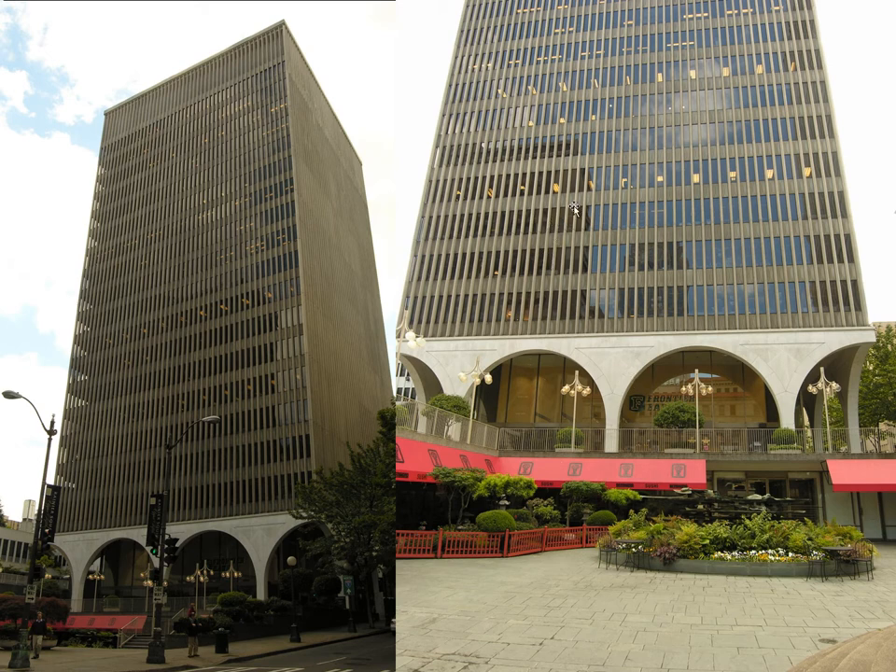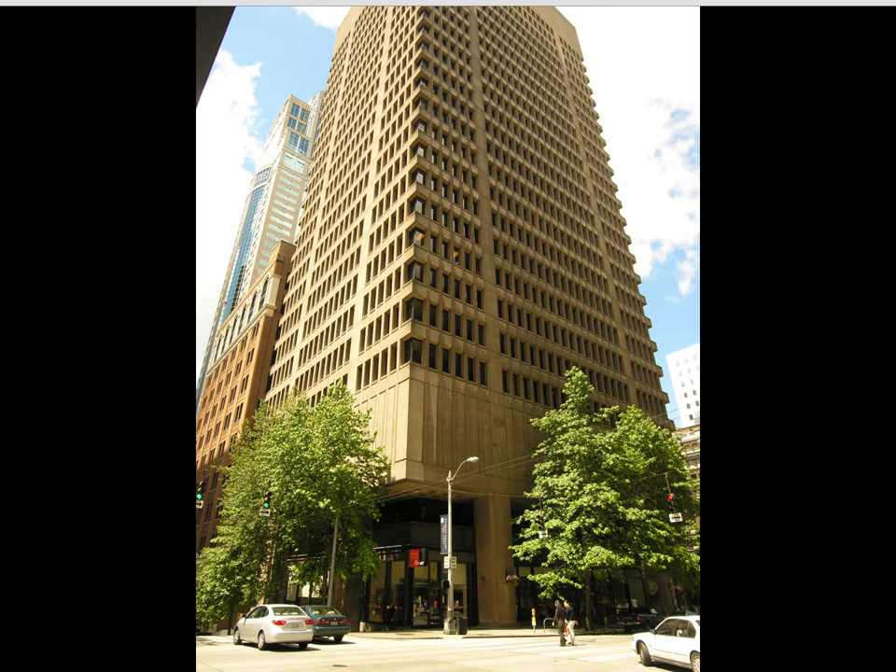There's an attempt to accumulate forces into the column by funneling them down through the shape. Alternatively, we can put in a monster deep transfer beam at the base of the building. In this case only about eight columns come all the way to the ground on the facade; all other columns deliver their loads to cantilevers or a simple span between two columns. If we're putting mechanical equipment on that second floor, we can easily use an opaque wall since we don't want people to see inside anyway.